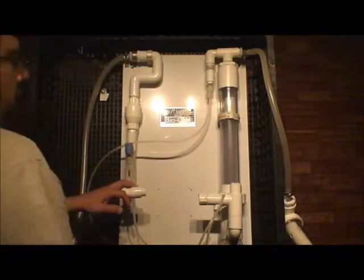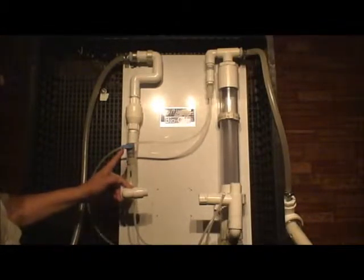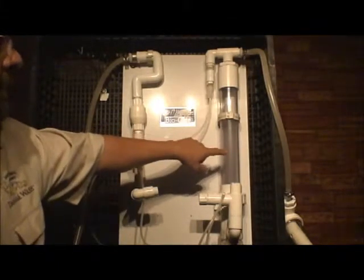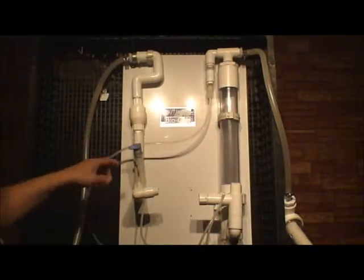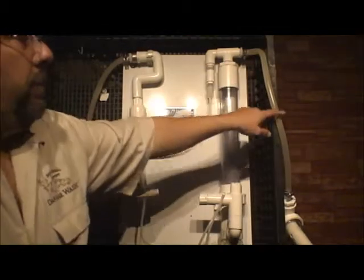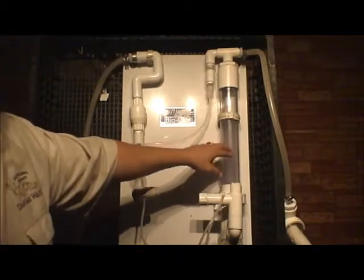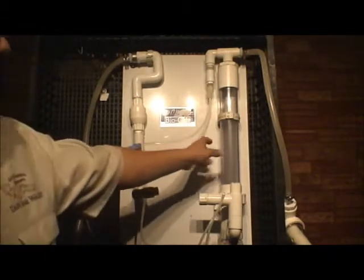The purge valve is there for the purpose of taking the sodium chloride and the acid that's in that center chamber. If you want to evacuate that in a very safe manner, you would use that purge valve and force that sodium chloride and acid out of the center cell into this flow, and then this tubing here could go directly into a drain and flush out that chemistry within the center cell, so that if you had to disassemble this, you would be able to do that without having any chemical within the center tube that would cause a safety issue or a safety consideration.